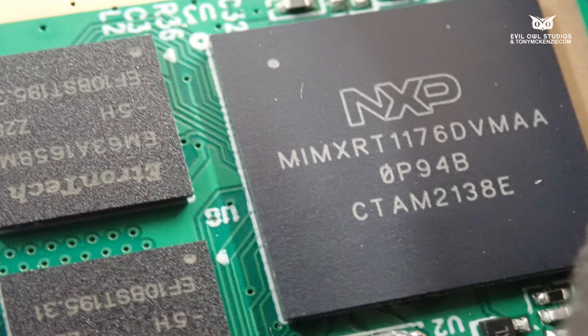And it says here, real-time low latency response is up to 2 meg of SRAM, 512K Cortex-M7 TCM plus 128. I won't bore you with all of that, because I'm going to talk about specs all day, can't I? But basically, it's fast real-time response with latency as low as 12 nanoseconds on some of this stuff that it does. It's also low power, which is important in a device like this, because what you don't want it to do is go chomping away at those batteries, if you're going to use the batteries, which I suspect a lot of people will. And you don't want it to vanish in about half an hour or something. This works for 7 hours.